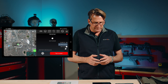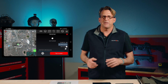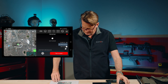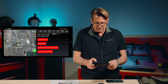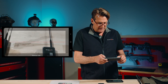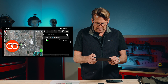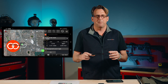One other important function is a breadcrumb — basically a Beartooth with no phone attached to it. You might want to put it on a drone, a water tower, or really get it up in the air to extend your range. Take the device with no phone attached, place it where you need it to be, go into Beartooth settings (the green rings), and click on Add Beartooth Device on Map. Once in there, scan it and take a picture of it, and that will populate the device onto the map. Hit Send to the entire Beartooth group, and that device will now appear on everyone's map so they can see where that breadcrumb has been placed.